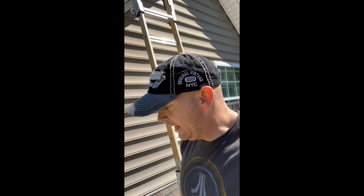Okay. So you want to be helpful? Barney style it for people. Most of these people are hitting me up saying, hey, I am not a tech person. I have no idea what I'm doing. Here's what you do. Get your antennas, get the cables, get the Mofi, find a SIM. Plug it in, see what happens. Move it up, down, left, right. Dial it in, look at the decibels, get them down to negative 100 or under, as close as possible.